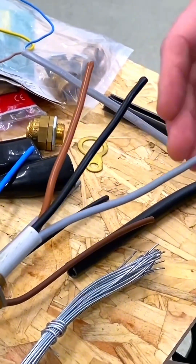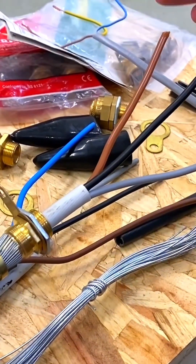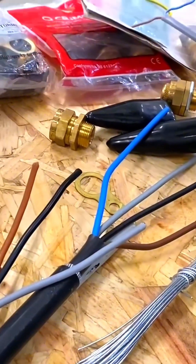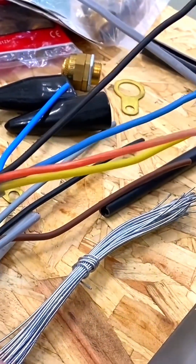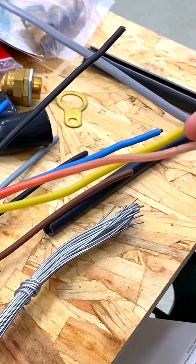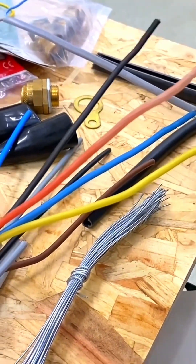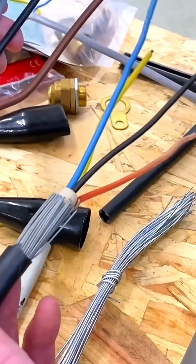Issues start coming when we interface old pre-2004 cable colours into our new post-2004 system. I managed to find this old cable deep in my garage. Our old three-phase colours were red, yellow, and blue — so L1, L2, and L3 — and black was our neutral.